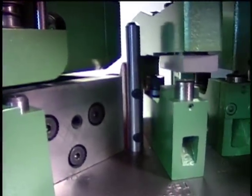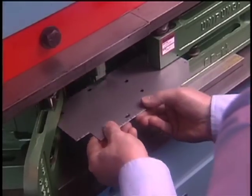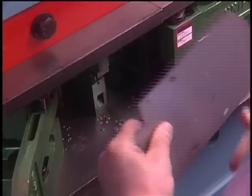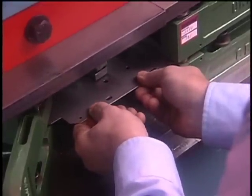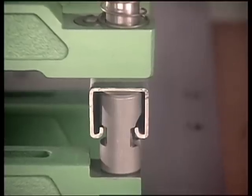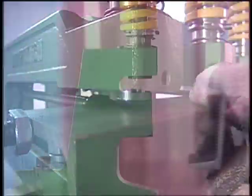You can combine punching units with units that are capable of corner notching, V-notching, or edge notching, so that you can punch holes and notch parts in the same setup at the same time. This tooling system is not limited by size or weight, and thanks to its versatility, the Uni-Punch tooling system can punch a wide variety of differently shaped parts, including tubes, castings, roll-formed parts, extrusions, and structurals like angles and channels.